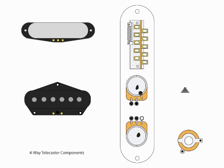First thing we do, as always, is set up the ground. We ground the two pots together and ground from one of the pots to your bridge grounding lug, however you have that in your particular guitar. We can then put in the capacitor — going from lug two of the tone pot to lug number three of the volume pot. It's important to note that lug number three of the volume pot is grounded to the top of the chassis. Make sure that is the case; if not, you need to ground lug three to the top of the chassis.